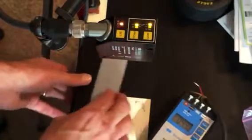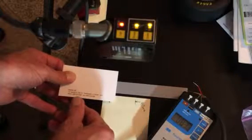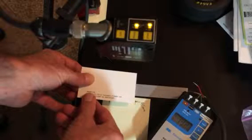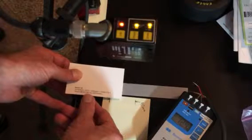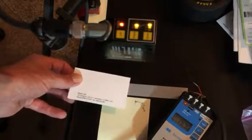And it learned the new range. So what I'll do is move these, put this back across here, and now I should have 4 to 20 milliamps across this 40 millimeter span right across here. Let's see — come across, there's five, six, seven, all the way up over to the other side is 20, come back over here in the middle should be about 12. If there's nothing there it's going to show four — just like here on the edge, you come across here you can see the 4 to 20. That's how you set it. Thanks for watching.